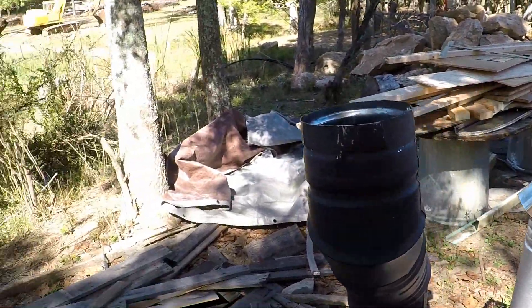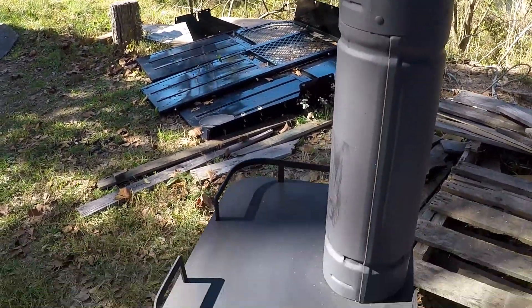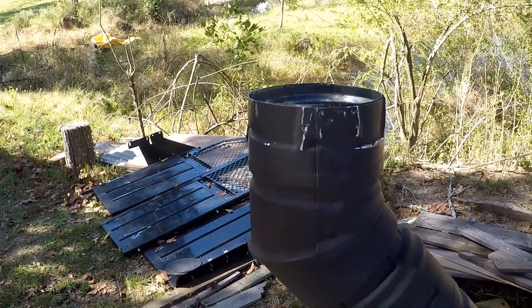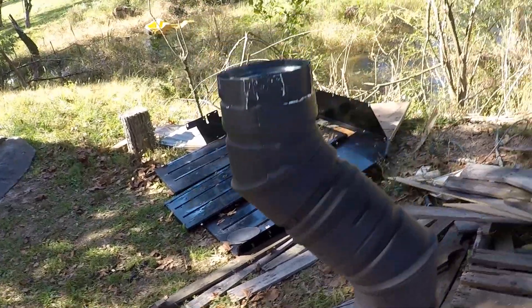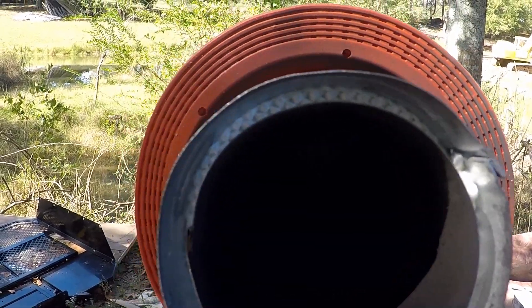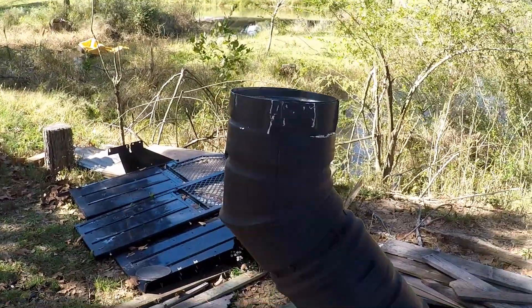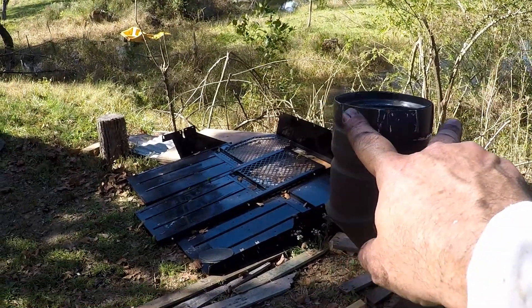When they first started selling the Cubic Mini, they sold a single-wall three-inch pipe. Come to find out that wasn't good enough, so we bought the DuraVent double-wall three-inch pipe. It can get a little pricey, but it's actually got two different pipes within a pipe. You can see right here there is a seal that goes over the pipe — that's the double wall and it seals it. That is super important.